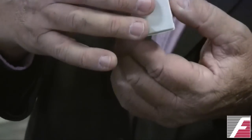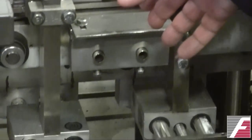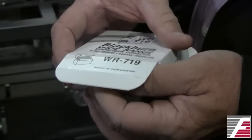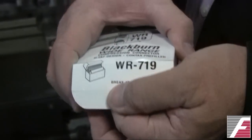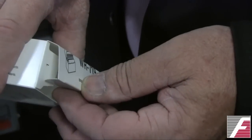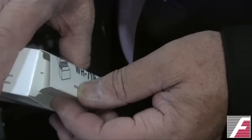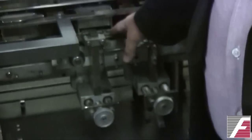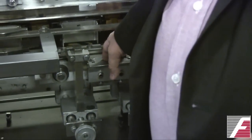One of the issues with this is that it's a very tight little section and can be tricky to adjust. If it's not adjusted correctly, you will not fold on the score lines — rather you will fold on the main portion of the flap, which means that the tuck is not in the right position, it's not going to go together, and it's going to cause a jam. This section can often be very ticklish to adjust.